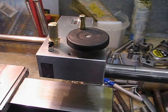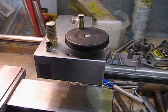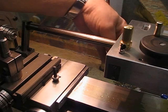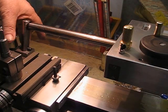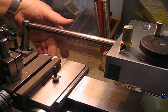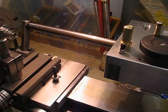The two columns at the back are attached to two blocks, one at each end, and that in turn engages with the dovetails on the back of the lathe. The only thing was that I found that the dovetails were not true with the bed.